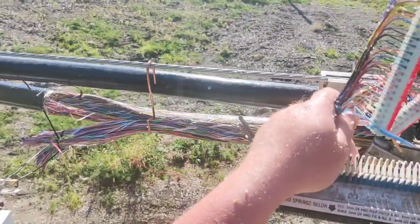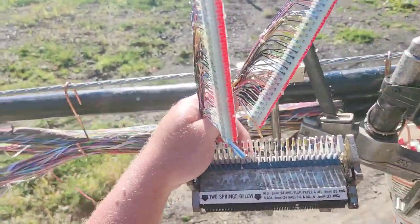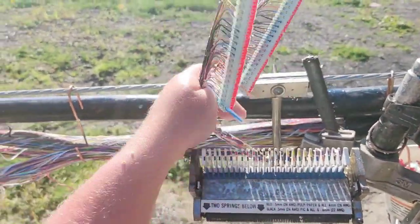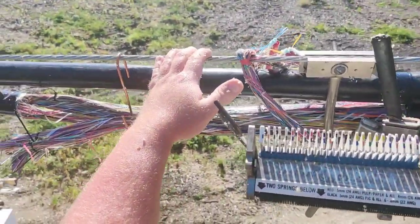That's it, you're done — then you just repeat the process. For the other side of your cable, you'll put minis on. You can plug them together with a crimper tool, or you can do them both in the splice head at one time. You can do the mini side first then do the pluggable side — it's a little more difficult sometimes, but it saves you on time. That's how you splice 25-pair.